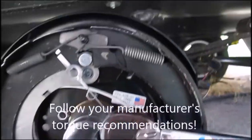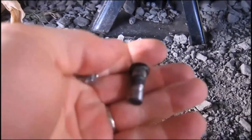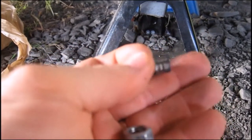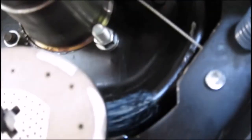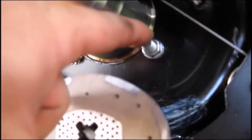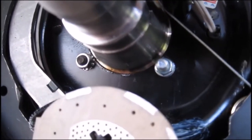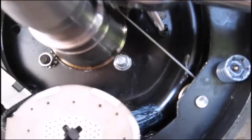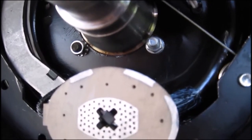I want to show you this — one of the bracket bolts was buggered up. I got to trying to undo it and it was fighting me the whole way. When they tightened it originally, they tightened it cross-threaded and just buggered it up. So I bought, anticipating this is probably an issue on other ones too, grade five automotive nuts and bolts to replace it — about an inch to an inch and a quarter, three-eighths inch in this case. I also put a lock washer on the front.